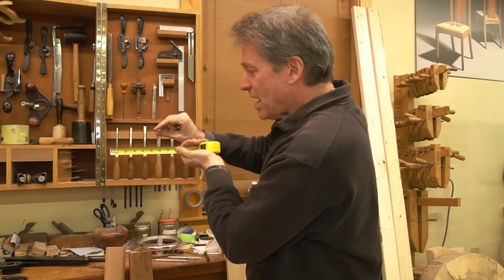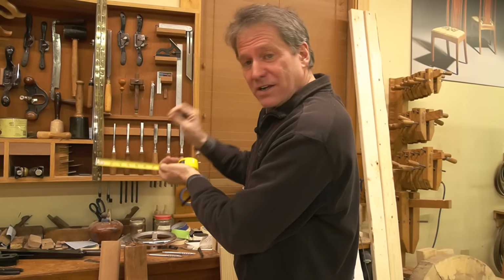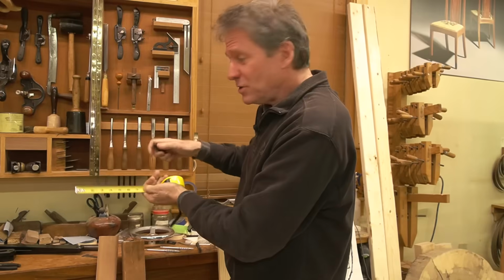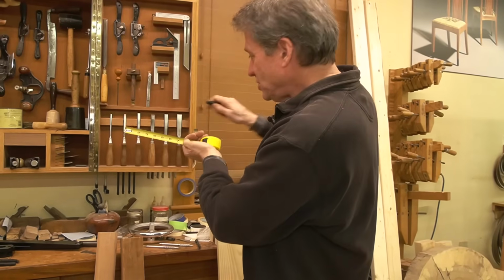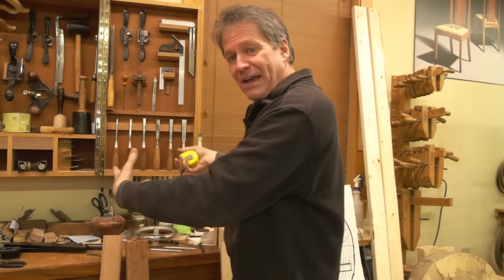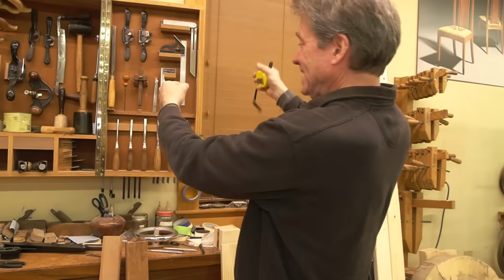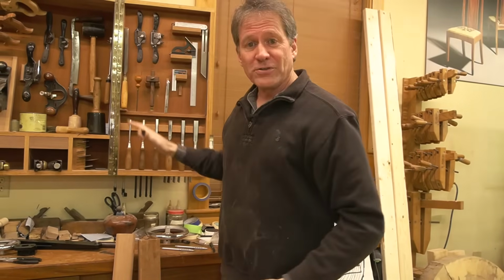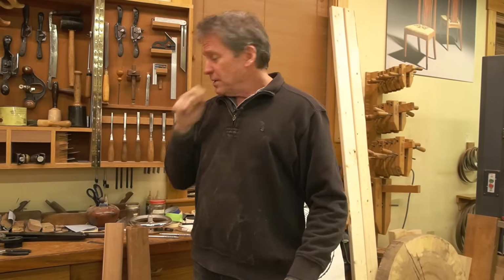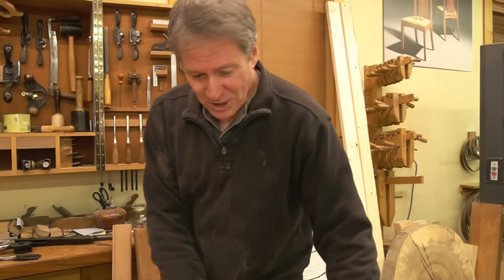If those growth rings are wide and far apart, I usually pass. If they're tight or close or reasonable, I'll give that end a check. And I'll just check all the ends of the boards that I want to pull out so I don't have to measure every single one. Once I get several check marks on there, I'll pull those boards out and stand them up and then check for further defects, maybe some knots or splits or checks or sapwood. But invariably, the first thing I look at is the quality of growth rings. Let me show you some examples of that.